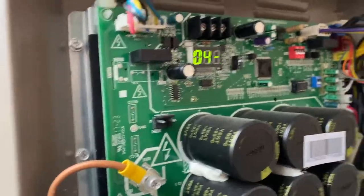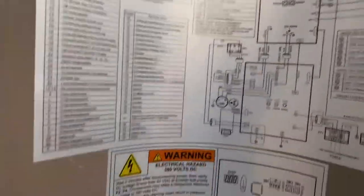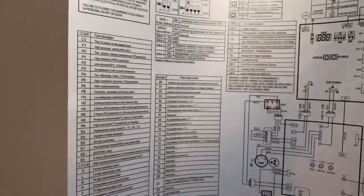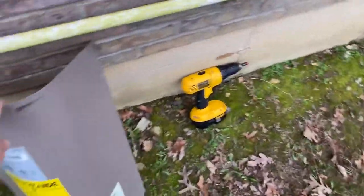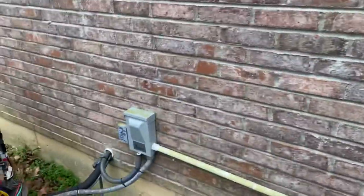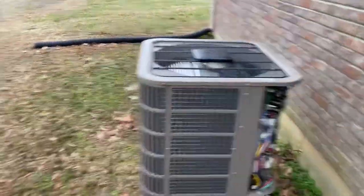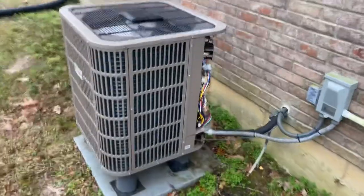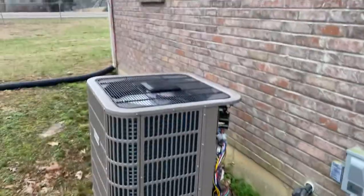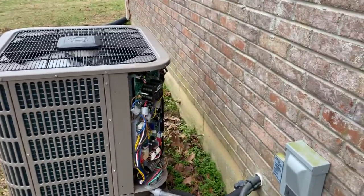I can cycle through all of these and it'll tell me everything that I need to know. I think you have to have the book — it takes a couple extra steps to know what everything is. It does have the codes on there if the unit's in a lockout. But if you have the book, because I can't remember it offhand, you can Google it too. You can actually press that check and cycle through everything as it's running. It'll tell you the pressures, temperatures, current superheat. So it cycles through quite a bit of stuff. Is it as easy as a communicating system? No. But I am still glad for it. Being a legacy system, I can still go in and read all of that.